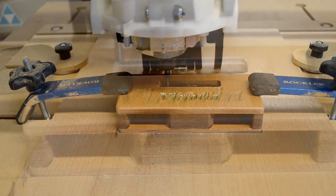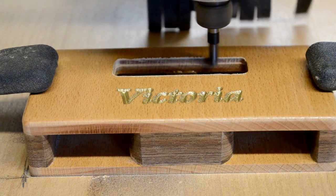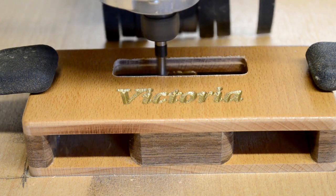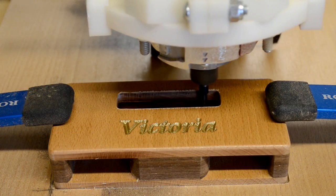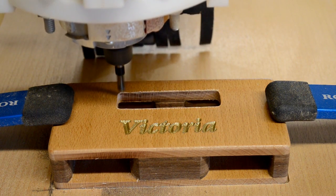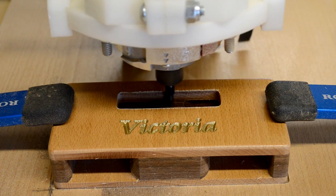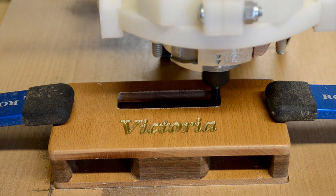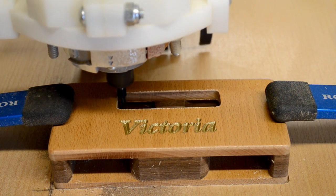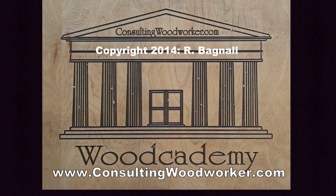This particular operation was a one-time thing, but as long as I don't move the fixture board, I can cut as many secondary operations in a row as I need to. And if I wanted to reuse this fixture in the future, I could use the router to establish a physical XY zero location, then when I remount the fixture I could just zero out to that physical location. So the next time you run into a situation where you need to do a secondary operation to a part that you've already made, you'll know how to do it.